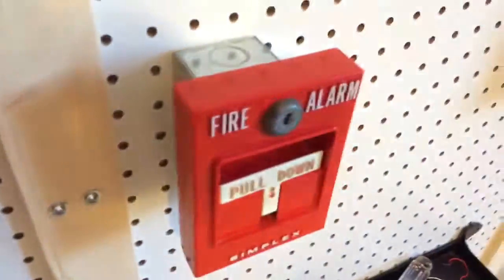Initiating devices are the same: the i3, the T-bar, and the MS6. Remote strobes are the MT, and out here is the EHMD. I did take off the dress panel for this test. The alarm out in the hall is going to be acting as a remote strobe, because my family's going to be really mad every time I test the system.